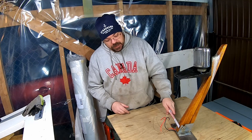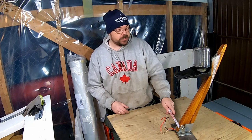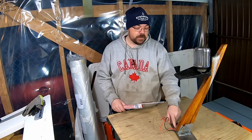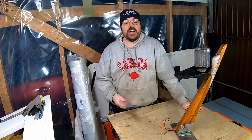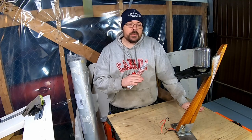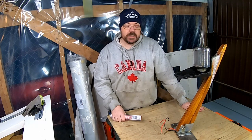The thickness of this old jack stand is about 4 centimeters, which is right about what I want for the new radar stand. I'm actually going to try and reuse the old stainless steel mounting brackets. I'm going to use what we in Sweden call 45x70 board, or piece of wood, with epoxy and biaxial weave as an outer layer. And of course I'm going to drill a channel inside for cables and stuff.